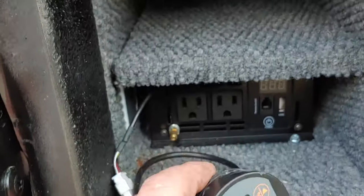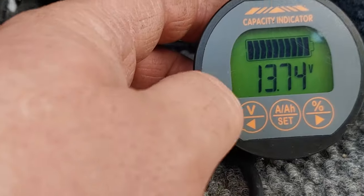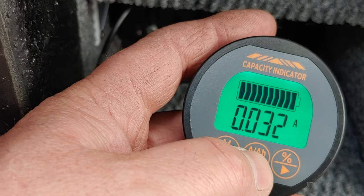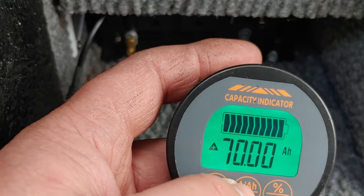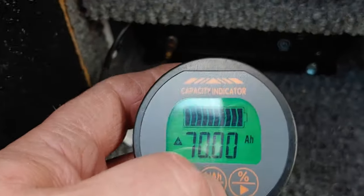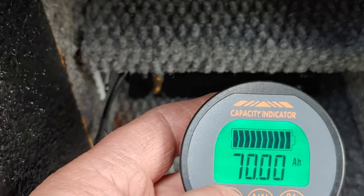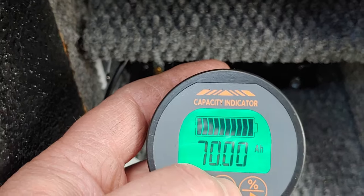Here is the meter I use to check my voltages — 13.74, that's 100% charged. You can see 100% — right now it's drawing 0.03, 0.02 amps, and that's pretty much just that little light. I have 140 amp hours of batteries, but if you cut that in half that leaves you 70 usable amp hours, so I programmed this to 70 amp hours. As it gets down to zero percent it'll drop to zero amp hours, but technically I'd still have another 70 amp hours in reserve. You never really want to discharge an AGM below 50%, so rather than putting it at 140 amp hours, I just put it at 70.